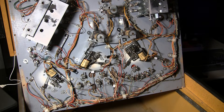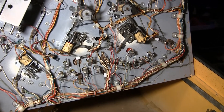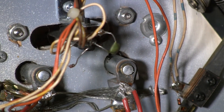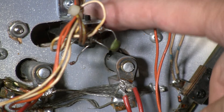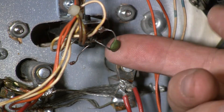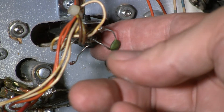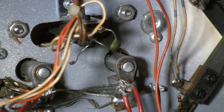Let me show you — there are two stand-up targets on this game, and the one in the front wasn't really working for me, but the one in the back was. So this is the stand-up target in the back, and you see that green thing? That is a capacitor. This is just a leaf switch up here, and this capacitor charges when the switch is closed and basically provides a little bit longer closure time for the MPU to sense. It takes just a tiny few milliseconds or nanoseconds to discharge, but it's enough to compensate for the lag in the MPU poll of the switch matrix.